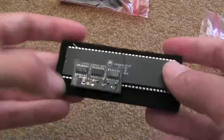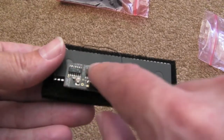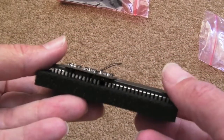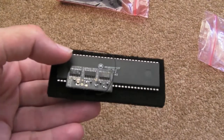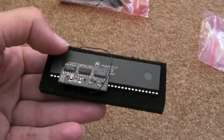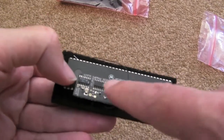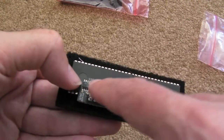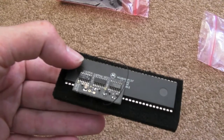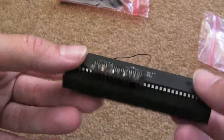This is the version 1 16 megahertz CPU upgrade. As you can see, he did a fantastic job here of shrinking the design down. If you watched some of my earlier videos when I got the 16 megahertz working, that was based on Chris's initial prototype. I did previously follow some of the guides already on the internet, and I think the basic logic was okay but it just wasn't a very good circuit and I was running into problems. I contacted Chris and he let me use the original prototype board. I was using three 374 logic chips with larger DIP type packages on strip board. That's how I implemented it — it works, it's been rock solid.